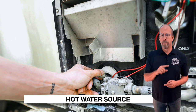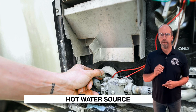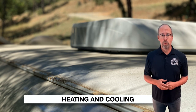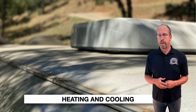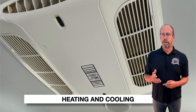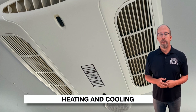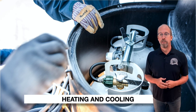There's the hot water source on this trailer — a propane hot water source with TPR valve at the top right, plus a vent connection and drainage. For heating and cooling, check the location and operation of the thermostat. Check the air conditioner cooling system for damage, cracks, or missing pieces; check the cover on the roof. Condensate drains through drip tubes that discharge under the trailer. Check the air filter. There's an electric heat pump that pulls ambient heat from the air and transfers it to the coil, heating the trailer without a fuel-fired furnace. Check the propane tank in the front — its condition and plate.